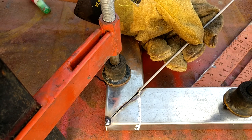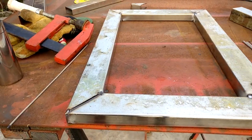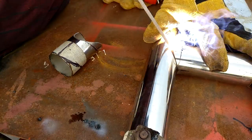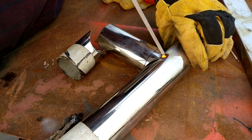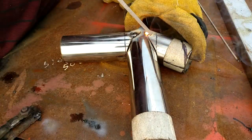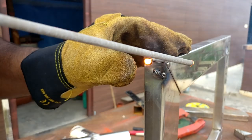Whenever I'm using an electrode as a filler rod, I always remove the outer covering of the filler rod and then use it to minimize the gap between the joint. By doing this, the chances of blowholes are almost eliminated. The reason for removing that coating is to avoid excess slag deposition onto the weld joint.